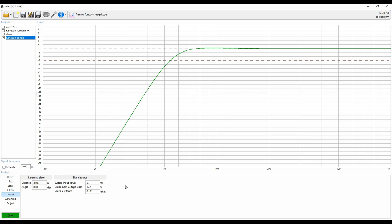The other thing we want to think about is how much power we're going to be giving it — that's what we put in the system input power. Then finally, how loud do we want it to go, and how far down in frequency do we want it to go? What are we using it for — music or movies? What is our end goal? If I want this to go down to 20 Hz, this particular alignment I've chosen wouldn't be good for this driver.